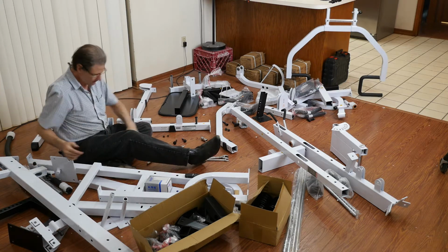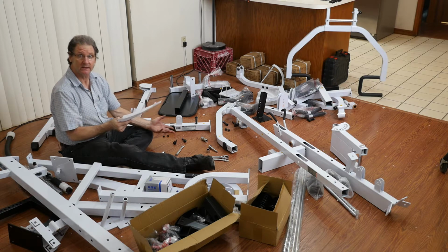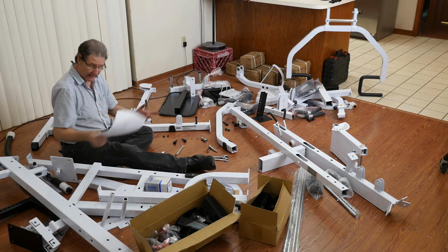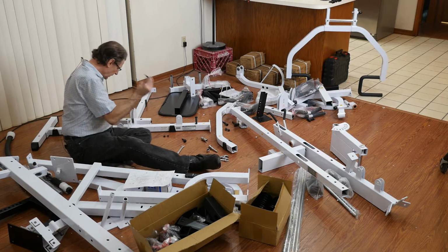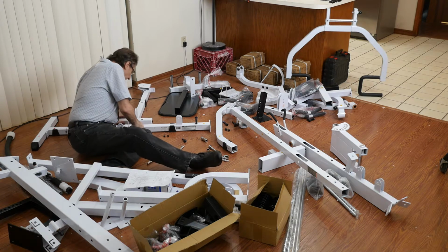These are page A6. These are 3/8 bolts, so 9/16 head. The head, the bolt, and the nut are the same 9/16, thankfully. And these are 2¾-inch long. They're A7 by their numbering system. So a single washer, there's a slot here, so that's why they want the washer on the head side. I'm surprised they don't do them on both.